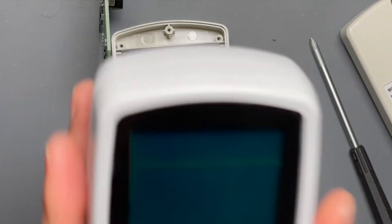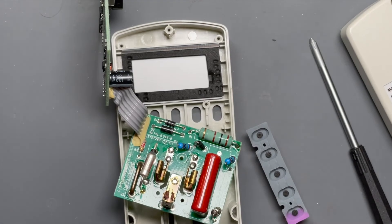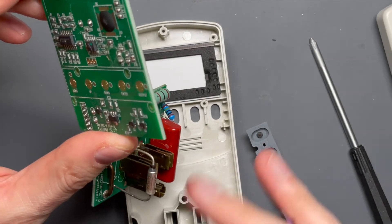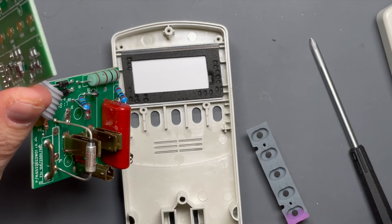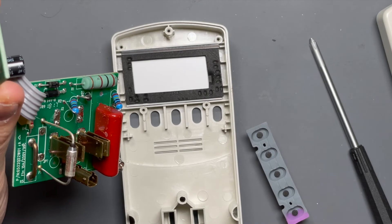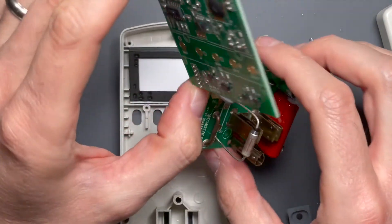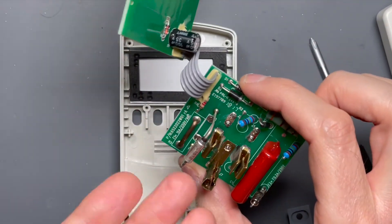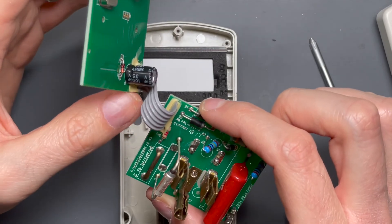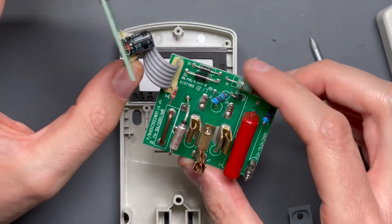It'll be interesting to compare this to the newer unit when I can get it opened up with the proper driver bit — and that'll be coming soon. I've used this Kill-A-Watt for many years. It's been a trusty tool for voltage, current, power monitoring, power factor, frequency measurements, and cumulative power consumption. For smaller loads when you want resolution down to the thousandth of a kilowatt hour, this one only goes to the hundredth, so it's better for larger stuff. It works reliably, the circuit board is pretty well laid out, and the design has some user serviceability — like replacing the thermal fuse if you overloaded it on a 20-amp branch. Hope you enjoyed this video — like and subscribe, and I'll see you in the next one.